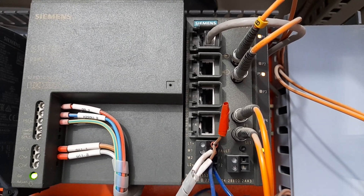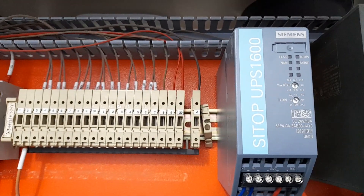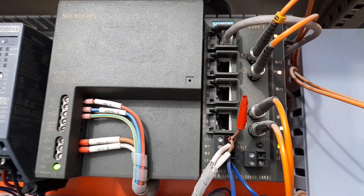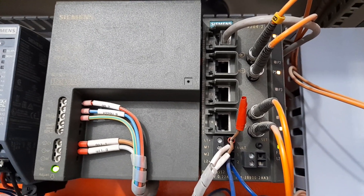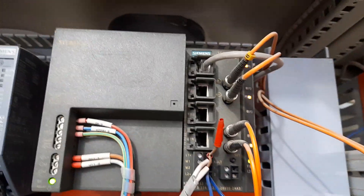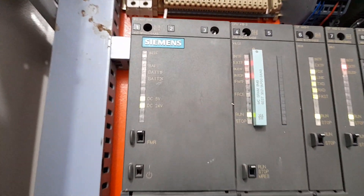The PLCs are connected into a ring network. This is a DC-UPS — its job is to keep the Scalance switch alive, because we do not want the Scalance switch to go off. The power must be available 24/7, energized all the time. The DC-UPS charges a UPS 1100 battery and keeps the Scalance switch alive.